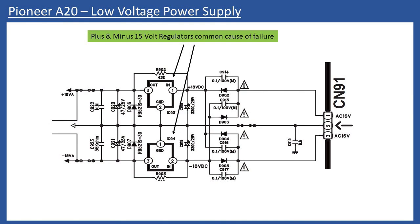The first thing to do is check the output and input of the low voltage regulators. Connect your multimeter negative terminal to the rear speaker ground connection, then probe the positive or negative output — you have to test both. Then reset from the front. What you may find is that you have a correct output voltage on one regulator, perhaps plus 15 volts, but on the other it's maybe 8 volts or nothing at all, or you may see physical damage to the regulator.